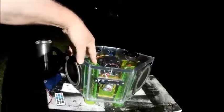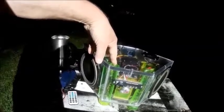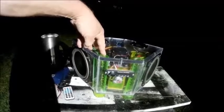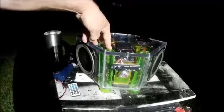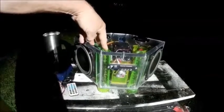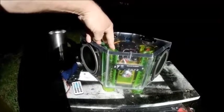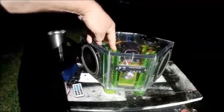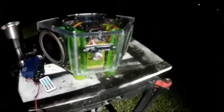The next batteries that go in it, I'm going to use 12 18650s, and that'll be 4P3S, 4 packs of 3 in series to make 12 volts, just a lot more runtime. Or actually, no, I'm sorry. It'll be 3P 4S. Anyway, you get my point on it. I think that's the reason I went with 9 and not 12.